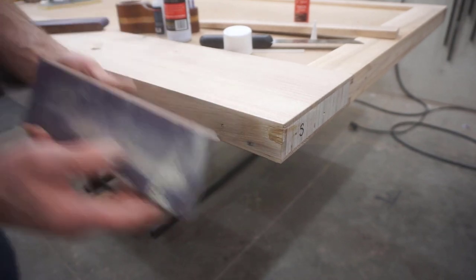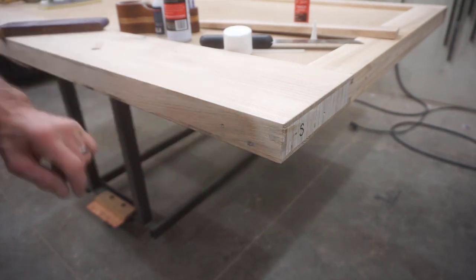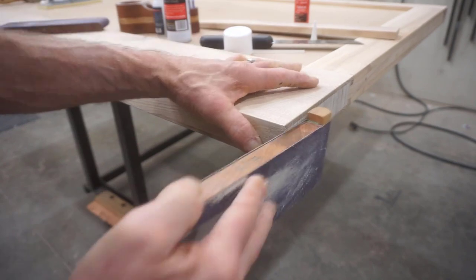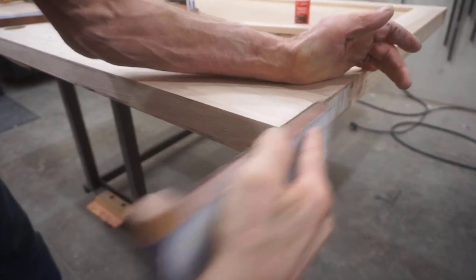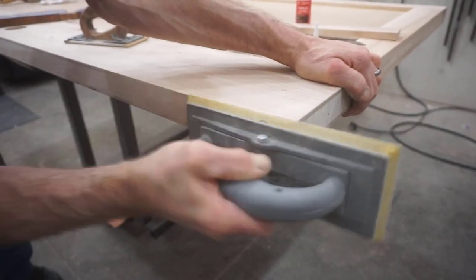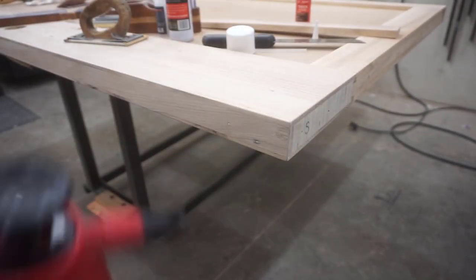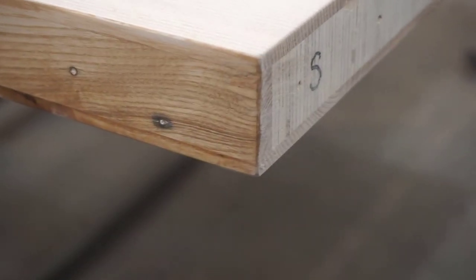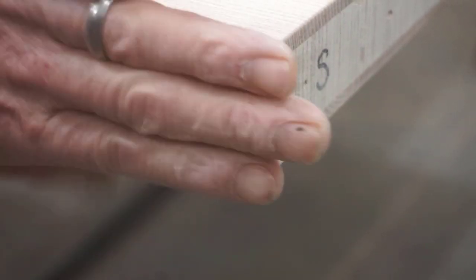In a few seconds that CA is cured. I go back at it with the 80-grit paper, making sure to put a good bevel on that corner of the door so this doesn't happen again. The 80-grit belt does the shaping and stock removal, and I follow it with 120-grit to smooth up the surface and remove the 80-grit scratch. With those initial steps complete, I follow up with 150, 220, and 320-grit sandpaper to finish this repair. Once the final sanding is done, a light spritz of alcohol shows you what the end result will look like when it gets gel poly — remarkably close to perfect for how bad that looked just three minutes ago.